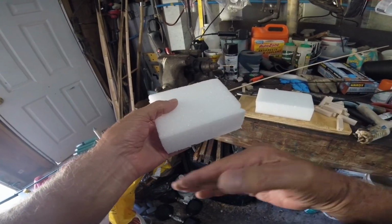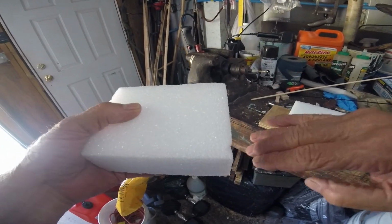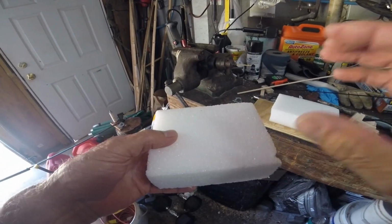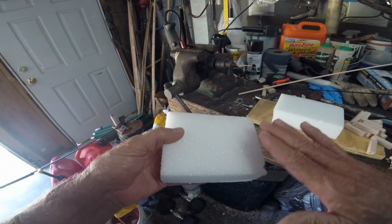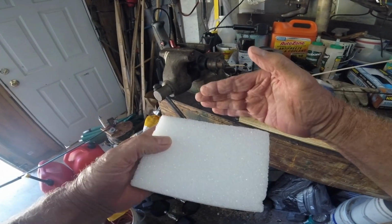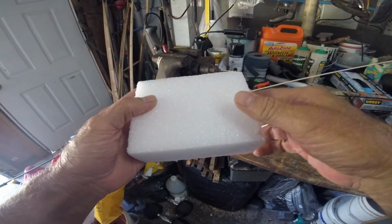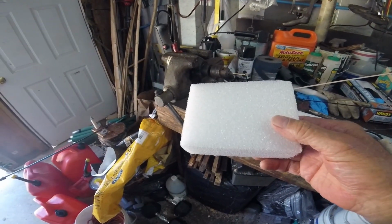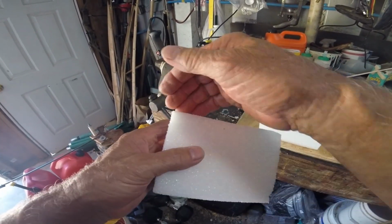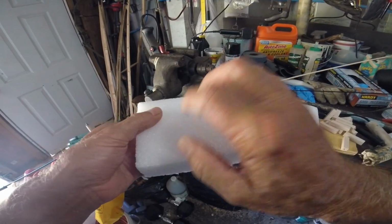Now I've created a big flange out here with those half balls on there. Those balls come out, and now I've got a concave in 4 points here. That's going to be a key lock. Now I'm going to mirror glaze this side, and with this flange, it's going to be coming out. I'm going to have about a 2-inch flange all the way around this thing. I may make a video of this if anybody's interested. And then once I do that on both sides, when that sets up, I can split it and discard this.